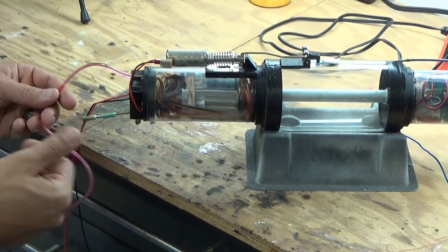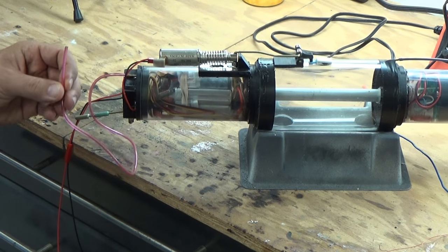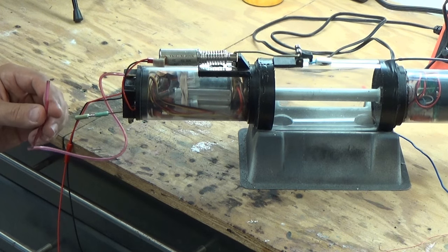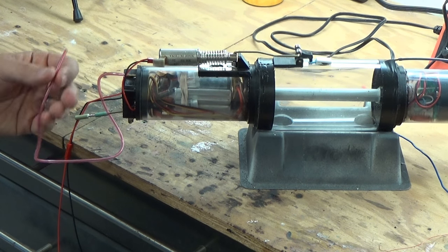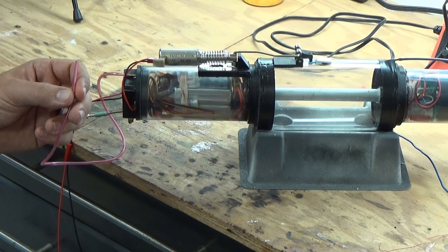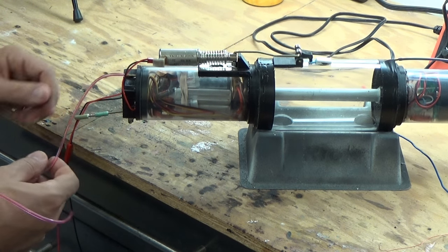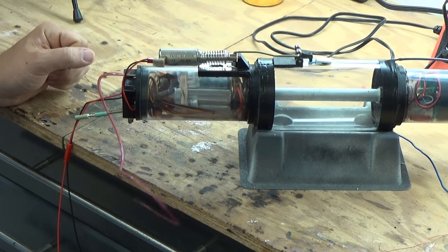The last thing we've got is a clear silicone tube, and this is going to allow me to test the cylinder — that's what we're going to be doing here in a couple of minutes. Simply blow into it and look for bubbles. Hopefully there are not going to be any. I like having it because it allows testing to be conducted really easily and effectively. Otherwise, what you need to do is seal up the cylinder, drop it in a bathtub or a pool, and wait and look for water. By blowing, you're pushing air out, so no water is going to get into your electronics — certainly a safer way of doing it.